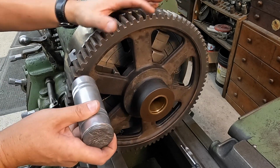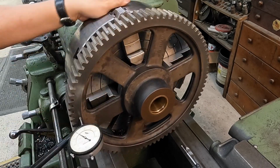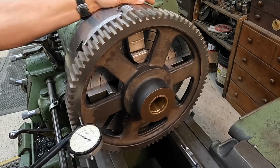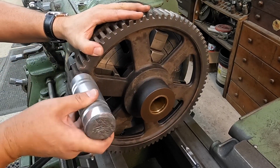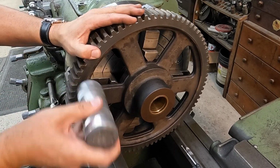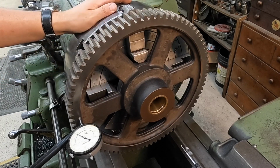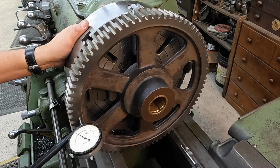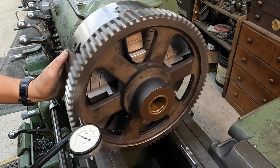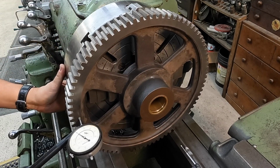So this is the highest one right here, about 2 thousandths. I didn't do anything. Doesn't seem like it's moving. There we go. Okay, so those two right there are even on the same number. Again, I'm not even worried about what line it is. I fixed it on that line where that needle's at. And right there we are 1.5 thousandths off.